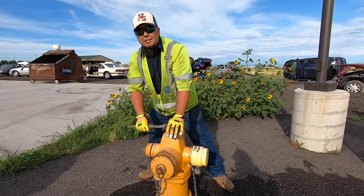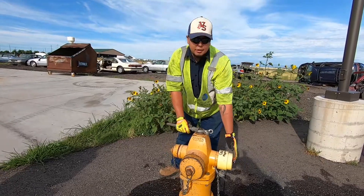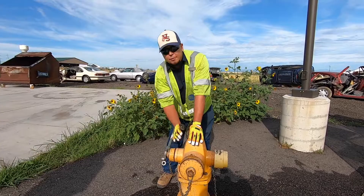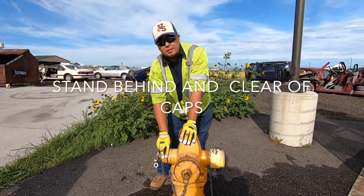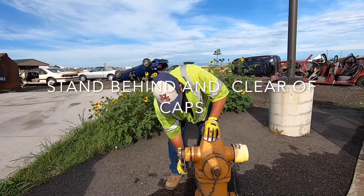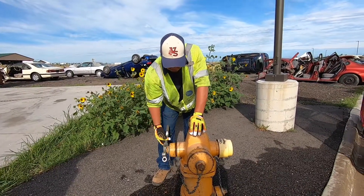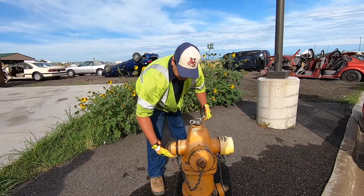One of the easiest things to do is use the two caps on the side rather than the recorder port, as the recorder will hinder you a little bit. These side caps can be used. There is leftover pressure in the hydrant after you turn it off, so you want to bleed it out — it's usually easier through the two-and-a-half-inch nozzle. Just go real slow and you'll hear the air start to release. You can use your hand and just wiggle out the pressure.